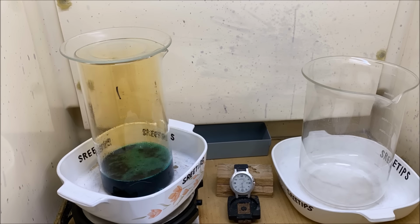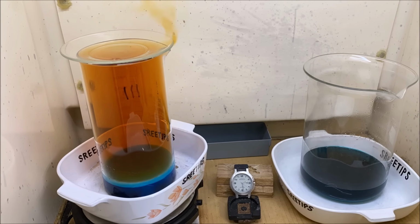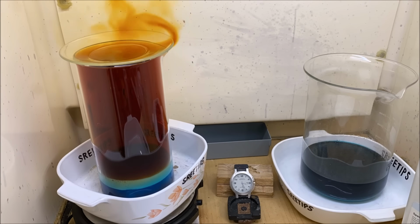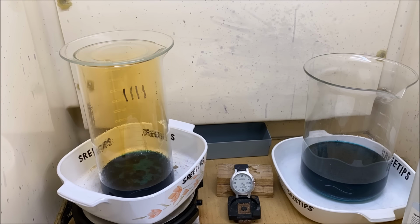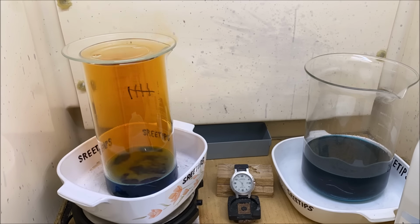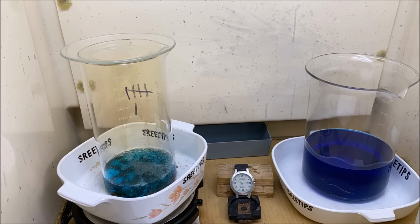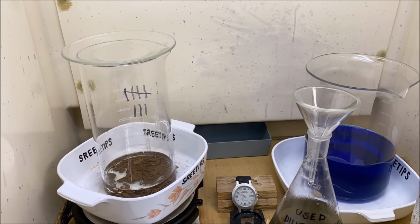What we've done here is reduced the gold concentration in that alloy by adding additional copper, and we've reduced the gold concentration down to 25% or 1/4 pure gold and 3/4 copper and other base metals that were already in the alloys that we started with. And by doing that, now the nitric acid can penetrate to the core of each piece of that inquarted gold. It cannot penetrate the high carat gold. It would just sit there and not react with that nitric. So we had to add the additional copper to reduce the gold concentration down to about 25%.